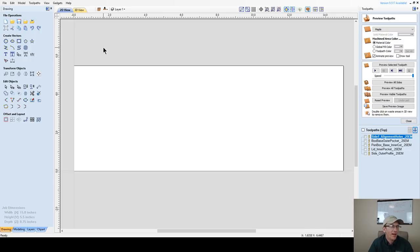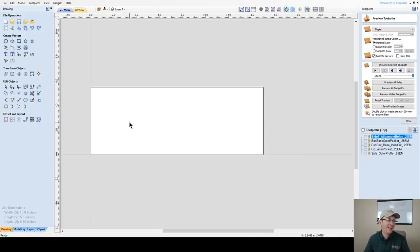We're doing it out of one board, guys. We're going to do it out of one board, out of here. And here's what we're going to do. Instead of gluing up the two boards before the carving, I'm going to create the base, a middle ring to give it some depth, and then the lid, because I don't want the lid to be 1.5 inches thick. I want the lid to be out of a 3/4 inch board. So we're going to use one board. Here we go.